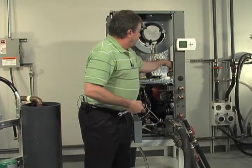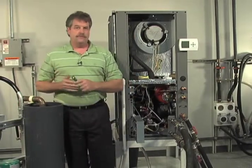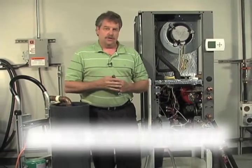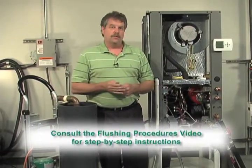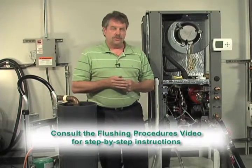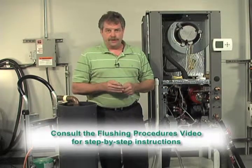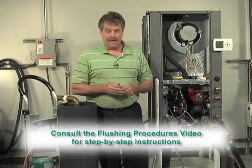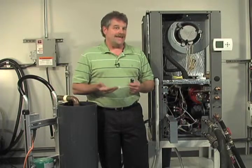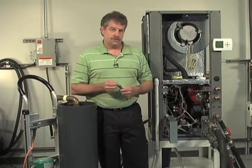One of the other components here is you must make sure that you are checking your antifreeze level. Again, one of the things that we want to encourage you to do, take a look at our previously filmed and available on the web flushing video. It goes step by step on a general or generic type of heat pump and loop field, but it also goes through the steps of verifying that you have the proper amount of freeze protection if in fact you're adding antifreeze. If you're in a heating dominant climate where your loop field may get down to 40 degrees entering, you must add antifreeze. You must add freeze protection.